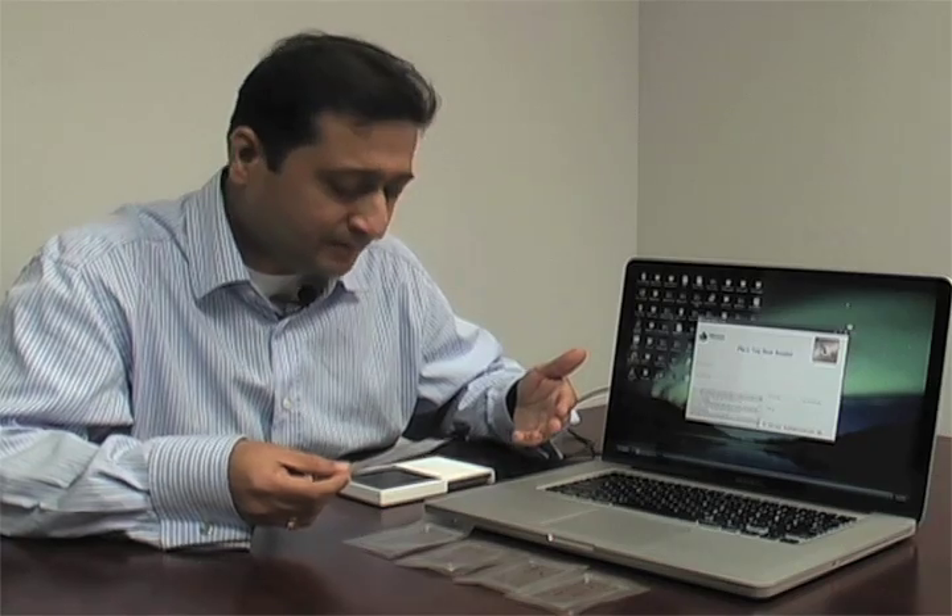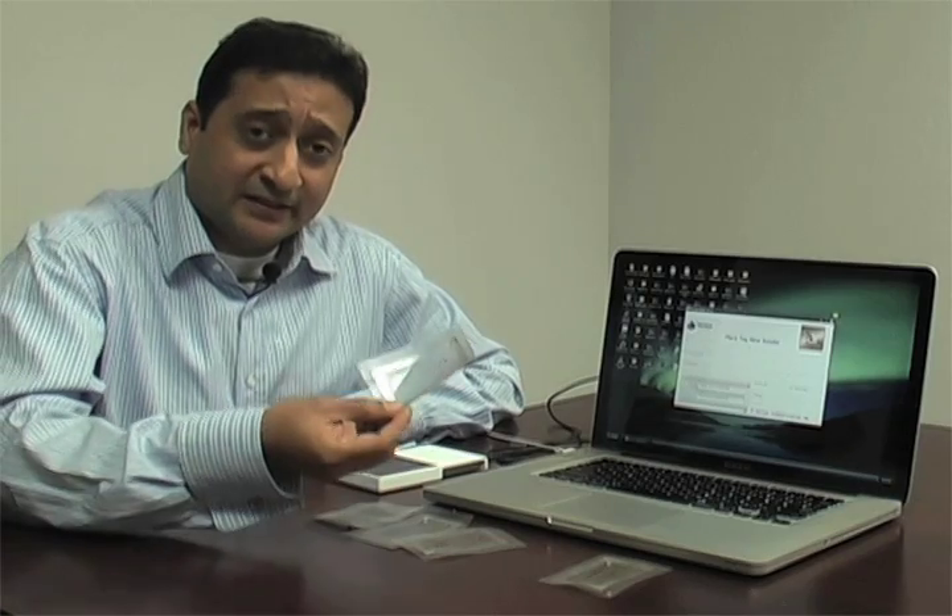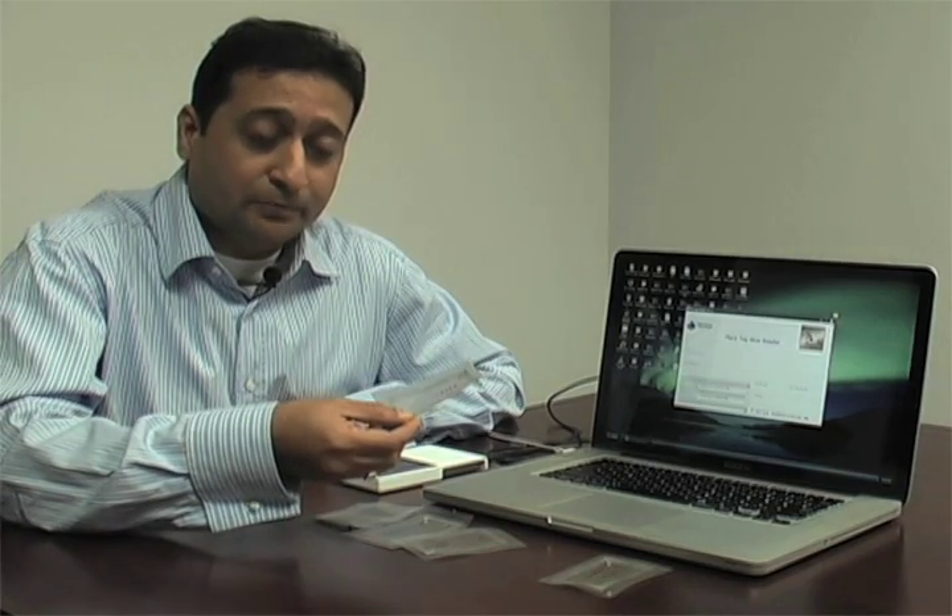Now if I repeat this experiment with another chip where I have copied the PUF parameters from one chip to the other — they don't correspond to the same physical device. The chip's tag ID is read, a random challenge and expected response are calculated. The chip gives its actual response, and the number of matching bits is much less than 96 — hence the chip is a counterfeit.